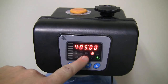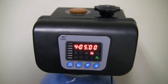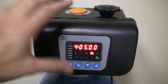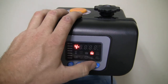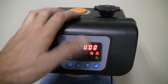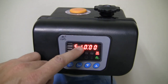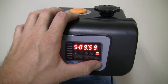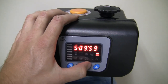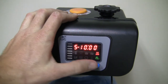This is the brine refill — you can see the little arrow showing the brine refilling the tank. What it's doing now is putting water back into the brine tank. Five minutes should be enough; it doesn't take long to fill the brine tank, so I wouldn't bother changing it. The final stage is your fast rinse, currently set to 10 minutes. You can change it or make it a little shorter if you want to, but I wouldn't recommend it at first — it's something you can play with later on. I'm happy with 10 minutes, so I press set. Now it's all set.